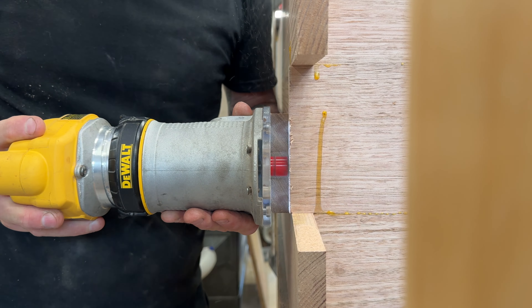I have to say that worked amazing. With the box test fitted, I'm happy with it. I've put that little piece on top — that's going to be the lid and the client has specifically asked for wide gaps on either side. There's going to be two latches on either side and then you might want to put a padlock in there. He specifically asked for 15 to 20 mil on either side. Next up is going to be to cut the opening where the piece of perspex will go in so you can see inside this box.